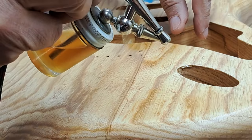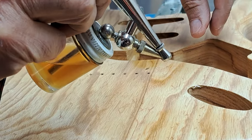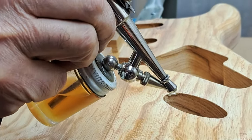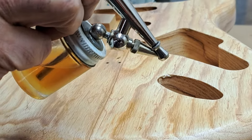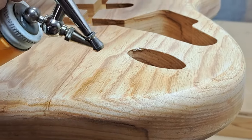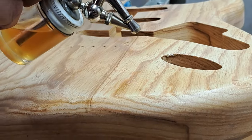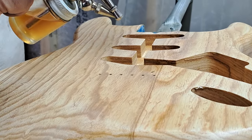A couple of coats of clear. That's cottonwood flying around today — I'm going to have to get this done and then wait till tomorrow to do any clear coating. But this is just a little tip with an airbrush: you don't have to slap another big coat on just because you're unhappy with a couple of spots. I've never seen anybody do this with shellac. I'm sure there's somebody out there who does, watching this going, 'I do the same thing.'